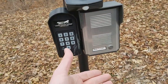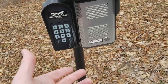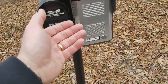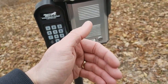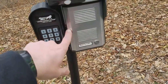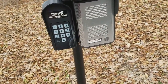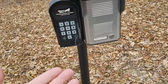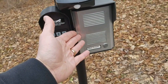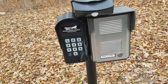You can also text the gate — there's so much you can do. You can have a sensor trigger that automatically sends you a text when someone pulls up. You can also just call it and it won't answer — it'll ring and open the gate just by recognizing your pre-programmed caller ID, which is great because you don't use any minutes. I use a T-Mobile pay-as-you-go SIM card — a minimum charge of $3 a month for 30 minutes or 30 texts. Keep about a $20 balance and put another $20 on every six months — very minimal cost.